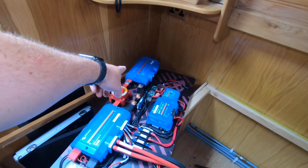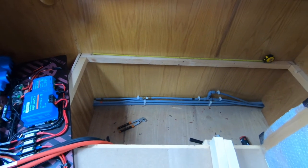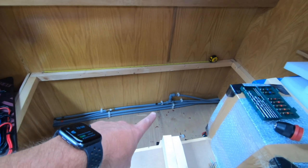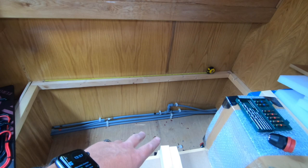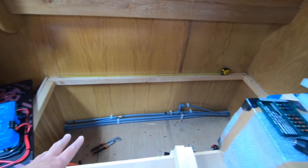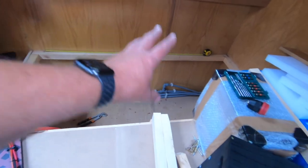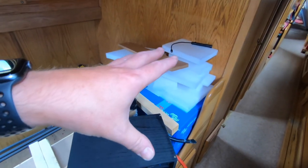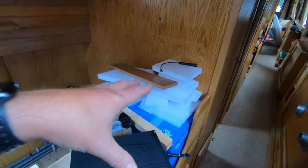They've pretty much built what I wanted to see — a case with BMS and Bluetooth. These threaded bars keep the cells compressed. They're covered in a plastic tube so there's no short-circuit risk. Coming out with a live and obviously the neutral — I'll probably need to extend those to bring them long enough to swing across and go into the Lynx Power In. All of this is going down here under the bed. This panel is mounted on these two bits of wood across the back, and then the inverter there.